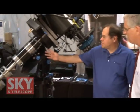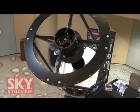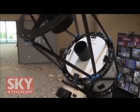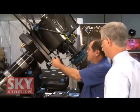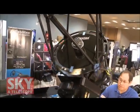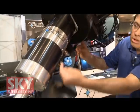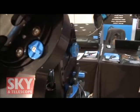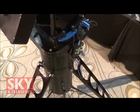Would you like to show me a few of the features on the 17 inch and the new mount? Sure. So this is the A200 mount. Some of the features of this mount: it can carry a 275-pound payload, which means it can carry our 24-inch. Now, I would caution that it works great in an observatory, but in wind I wouldn't use this mount for the 24-inch. It covers our 20 and our 17 very easily. It has through-the-mount cabling. When you have a telescope with cameras and everything on it, there are tons of cables. You can run underneath the dovetail, all the way down through the mount, out through this hole, then down through the hole that goes down the center — the RA axis. You can run an extension cord, USB cables, whatever cables you need for your setup. It's a big two-inch opening that goes all the way through the entire mount, so you won't get cables wrapped or snagging on stuff when you're slewing around.